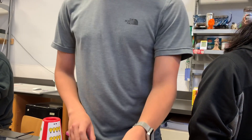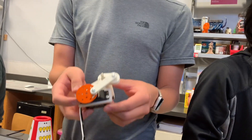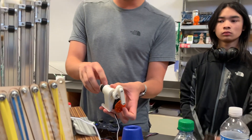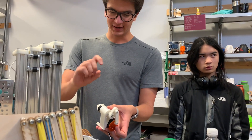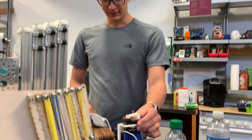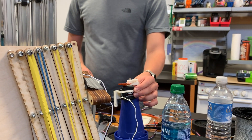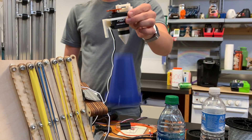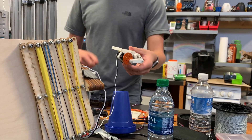So this is the new prototype for the grabbing mechanism. It's a cam such that as it rotates this expands out — as you can see you can drop it in, it expands, and there's a fair amount of force it can lift. Then when you cut the power it's able to retract and then it falls.